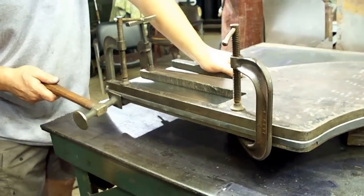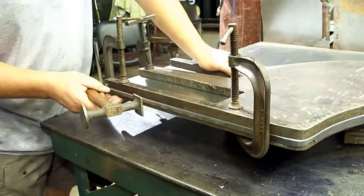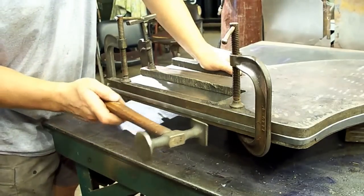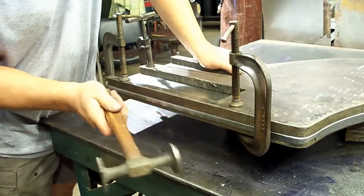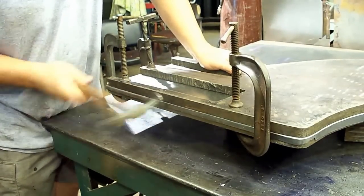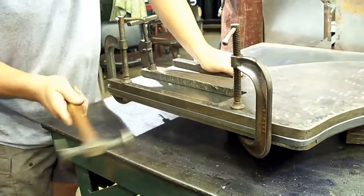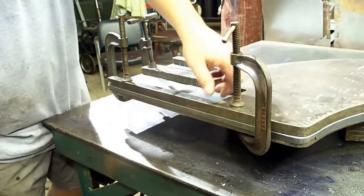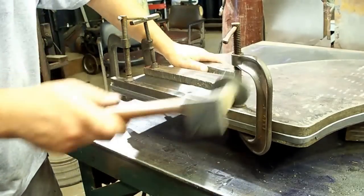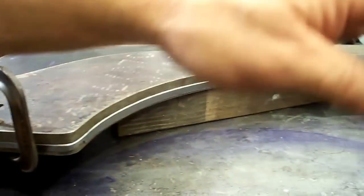Here's another area - we got it bent over. When you're bending it over you don't want to trap material up between the two panels. Take it down easy - you'll see it's kind of lumpy and gradual here and this is where we'll sharpen it up again. That's a nice tight edge. It's fitting the form real good and it's ready when we go over the whole thing for final finishing. This whole bottom side is basically ready to go.